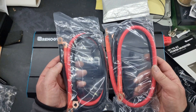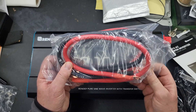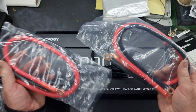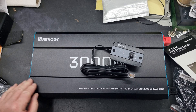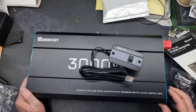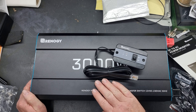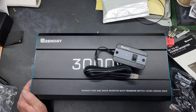You get two cables — you have to link them together. They're not a really thick gauge so we'll double them up. I'll be linking two batteries together, so I'll have 200 amp hours and might get another one at a later stage. I've got quite a big solar panel and a DC-DC inverter so I can produce quite a bit of power when I want it.